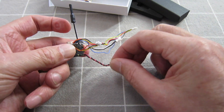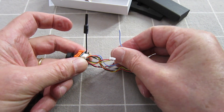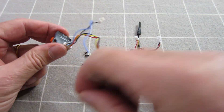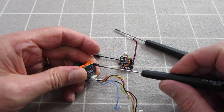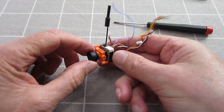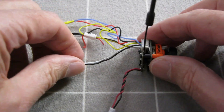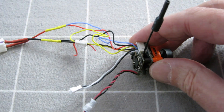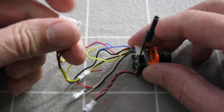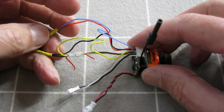Alright, so we need to have separate power inputs, but we can connect the video and ground together, and the blue wire taking off the flight battery somehow. So I'll mount them up together — I just need a really fine screwdriver to undo these screws in the back of the camera and pop the standoff in. So now we can pop this little fellow in. There we have the neat little backpack, just have to work out how to power it up. Here's what I've come up with for the wiring: to power the transmitter I'm going to plug it into a receiver or ESC to provide the 5 volts. For the camera it's going to be powered off the flight battery, and I also have the blue wire connected to the red wire coming from the flight battery so that I'll get voltage telemetry on the camera.